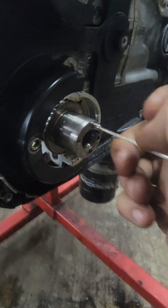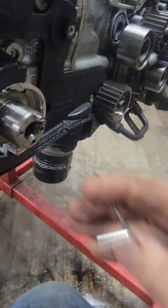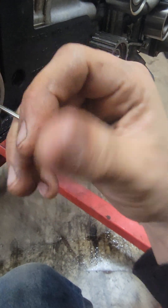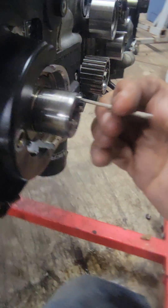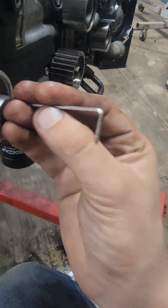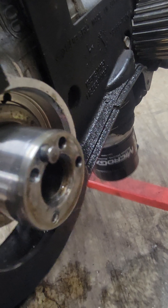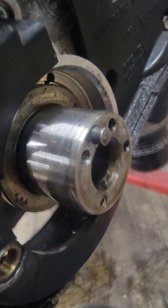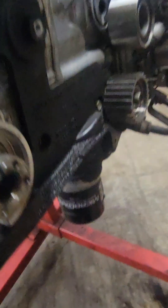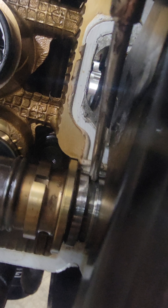Let's find out if I've gone deep enough on the second one. It's a little proud still, so I'm going to take this apart again, run the tap another couple turns, then blow it out and install it for real. Here is the hole we're going to go through to blow out the shavings. You just have to go through all four of these and make sure every hole is clean when you're done. A little too deep is okay. The last one's tough but you can get it.